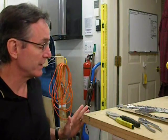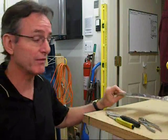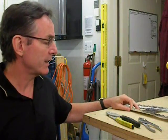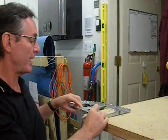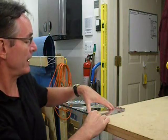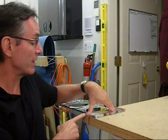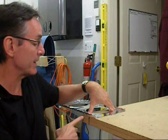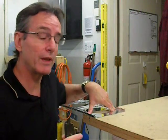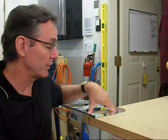This corresponds to the distance I wanted between flutes and also corresponds to the distance between two holes on the ribbing flange. Next, I put the rib on the workbench so that the spot to be fluted was directly above the spot on the workbench. Then, I held the rib firmly on the table with my thumb and fingers. Specifically, the thumb is pressing directly on the spot halfway between the end of the bench and the mark, to hold the rib flat against the workbench during the fluting process.